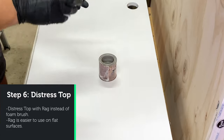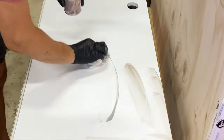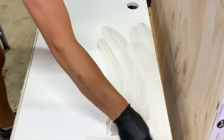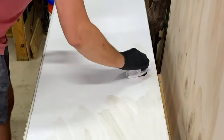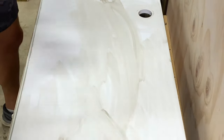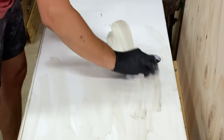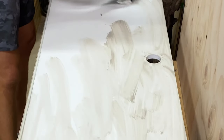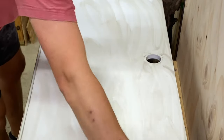Use one rag to apply the stain — just dip it in. You want to go over the entire surface with the stain, so it's going to darken up the white paint. My favorite part about distressing painted furniture is it's easier to control the amount of stain that seeps into the paint. The more that you wipe, the more that comes up. If you want to achieve a darker look, just don't wipe as much. Pretty simple.